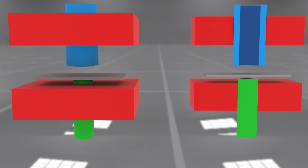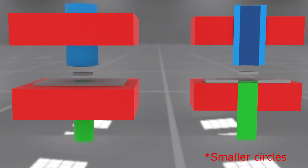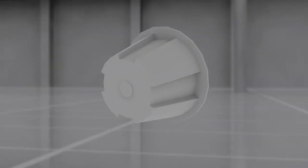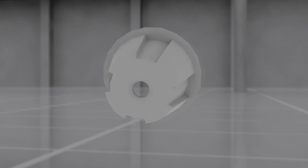The flywheel cup starts off as a large thin sheet of metal, then smaller squares are blanked out of the sheet. These smaller squares are then deep drawn to give the shape of the part, including the grooves. Once the part has been deep drawn, it is likely that the next step in the production process is to pierce the hole at the base of the cup.